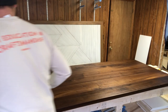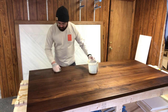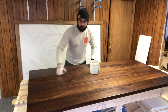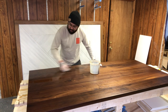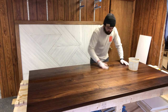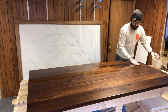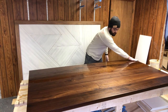Doing it this way you don't have to sand between coats, which is huge — I hate sanding. Usually I use two rags when I'm doing this method: one to get all the excess off and another one to level it down. I just dip the steel wool in, get it nice and soaked up, then rub it on. I'll burnish it on, so I'm basically sanding again while I'm putting finish on the table. As you can see it produces a really fine finish. I get the whole side, then go all the way down to make sure I get it nice and even with the grain.